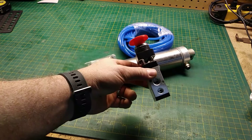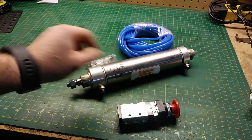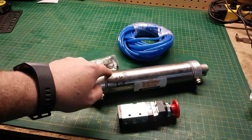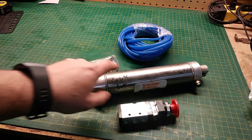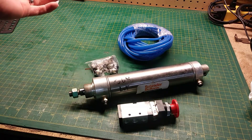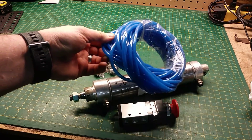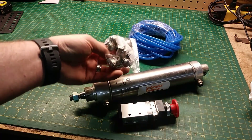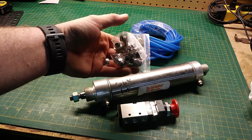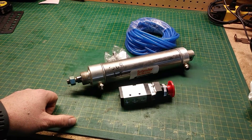You're going to need a pneumatic switch — I'll put a link in the description, I actually got it from Amazon and it's pretty inexpensive. You'll need a pneumatic cylinder, which is probably the most costly part of the build, but around 15 to 20 bucks if you dig around on eBay and buy a used one like I did. You'll also need pneumatic air hose of the appropriate PSI, some fittings, and some scrap metal — or go to the store and buy new. We're going to ad lib on this build and see what we can come up with.